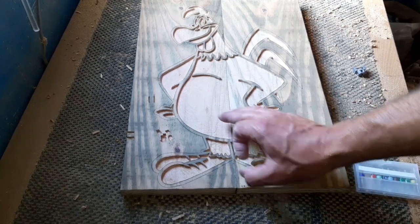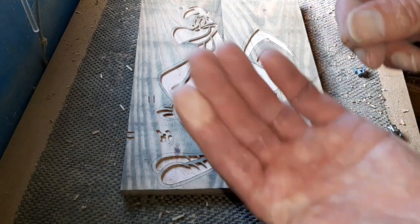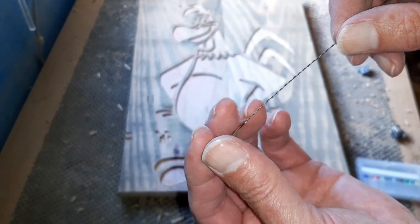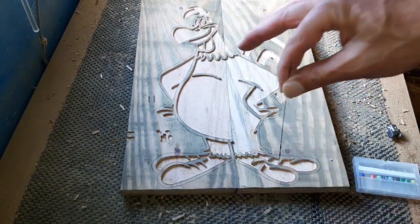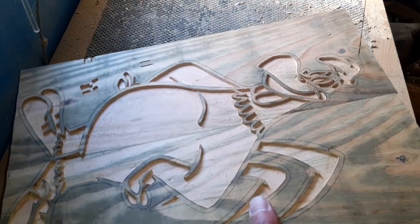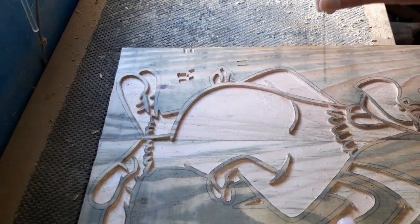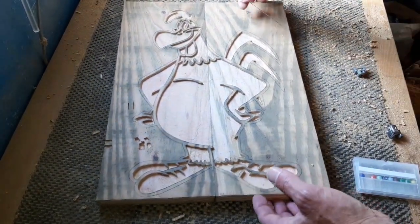Now for me, I like to use spiral blades on a scroll saw. They are spiraled the full length of the blade. They're a pinless blade, unfortunately, and you get smooth on the way down, rough on the way up. This will cut in any direction, a spiral blade. So you could literally put that on your saw like that, start there, and just feed that round like so. No problem whatsoever. I do prefer spiral blades. They're not for everybody. You'll either love or hate them.